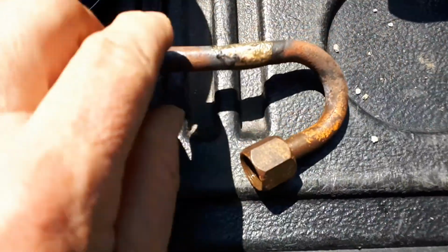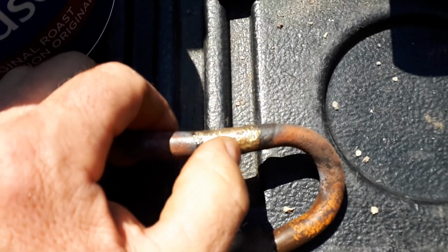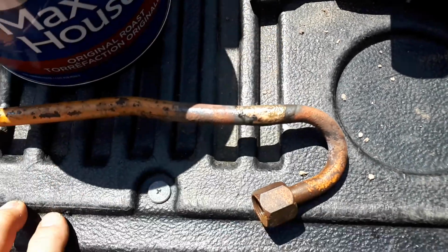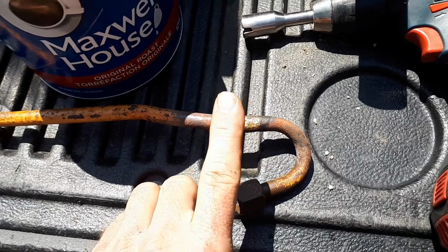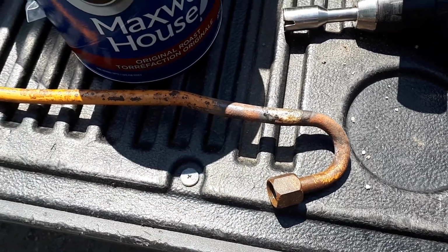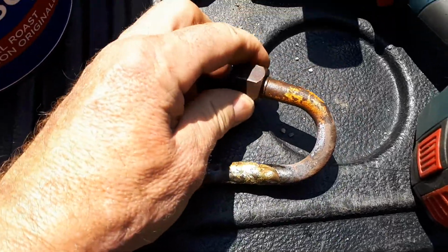Perfect. So I brazed this last night. A little rust developed there. That's where it clamps on to the stabilizer on the backhoe, and then the metal got very thin, and it just popped open, and a bunch of oil squirted out. So I just clamped that in the vise, and these things would not turn at all.